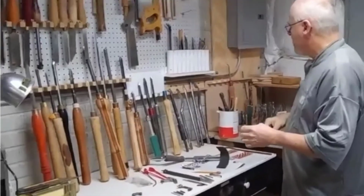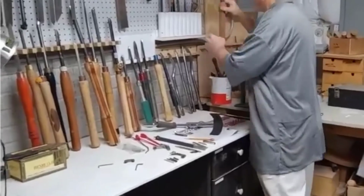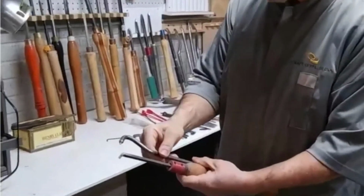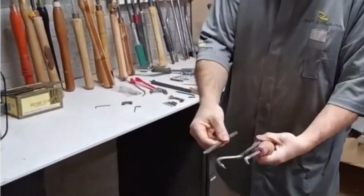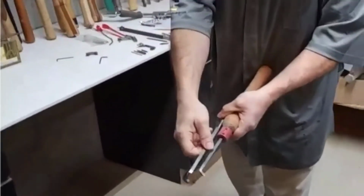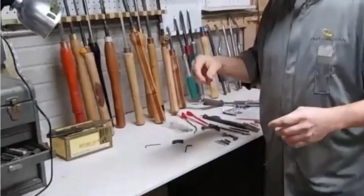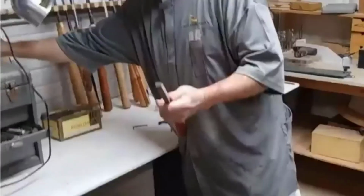For very small hollow forms, you can use 1/4 inch, and I do have some of those. There's a square shaft, 1/4 inch square, with a piece on the side that's like a Bob Rosand design, and then the straight cutter also goes in that same piece. That gooseneck shape also could work with the half inch diameter, but I bought that, but I've never used it yet. These are my carbide tools.